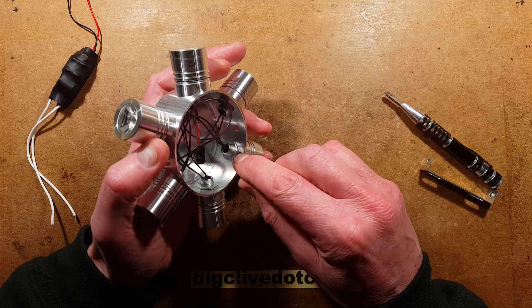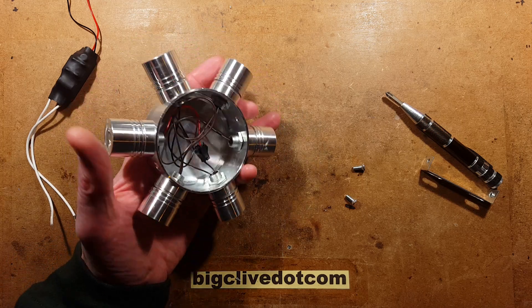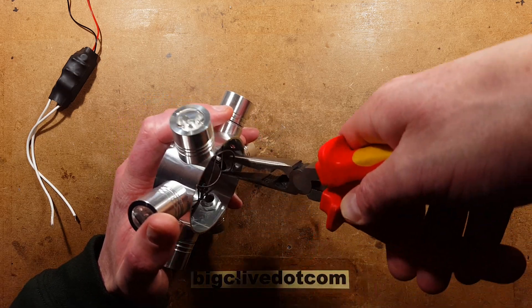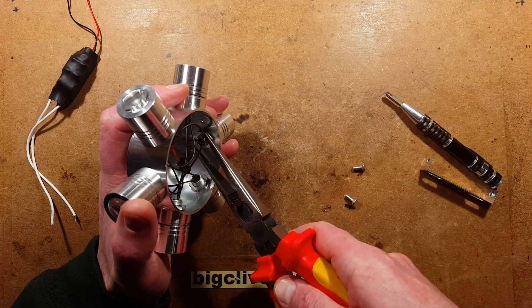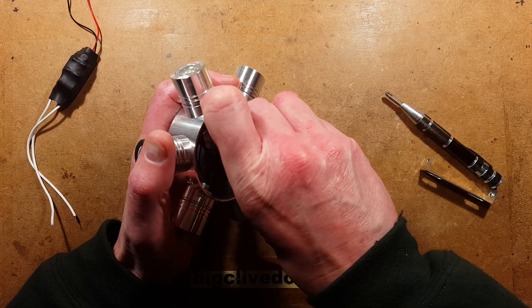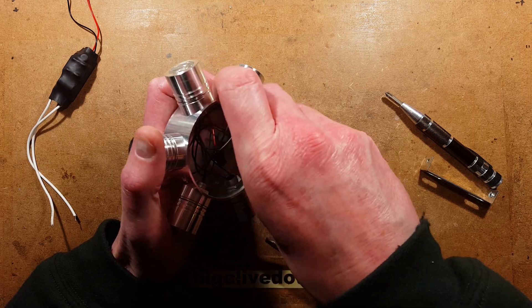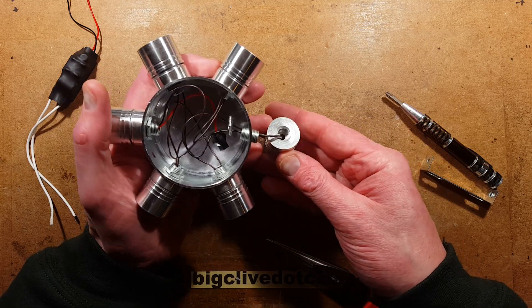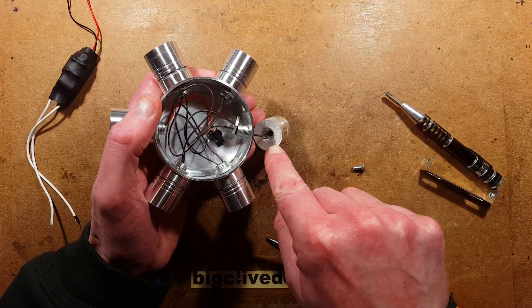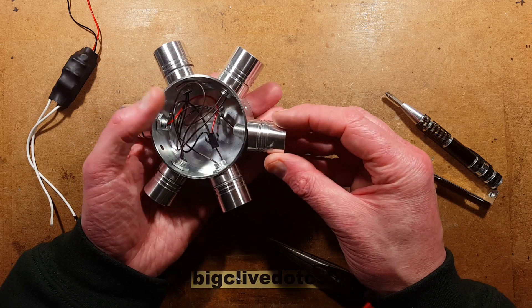Interestingly, it's got a threaded section. I'm going to grab a pair of long-nose pliers and loosen that. Is that just a piece of threaded hollow studding - standard lighting studding going in here? Yes, it is. It's just threaded in, and then this hollow studding screws into that, with a nut in the back. Because this is machined with a slight curve, it sits snugly onto that and you can't rotate it on its own. That's very neat.